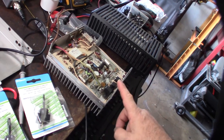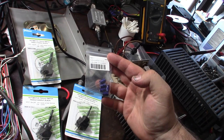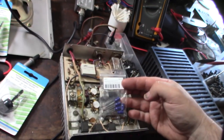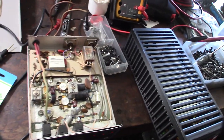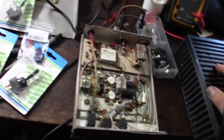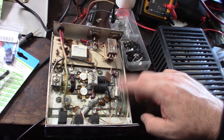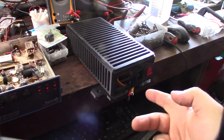I also picked up some new Nichikon capacitors - 47 microfarad, 35-volt. The originals were 47 microfarad, 25-volt, but look how much smaller these new ones are. I tested the old ones on my ESR meter yesterday. They're both rated 85 degrees Celsius. This one I had trouble finding a replacement for. These are 50-year-old amps so it's not easy to replace some of these electrical components.